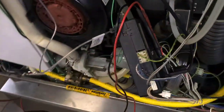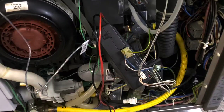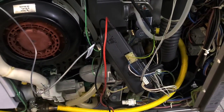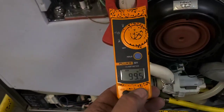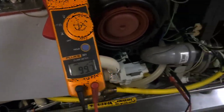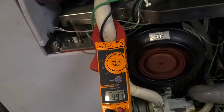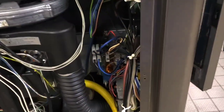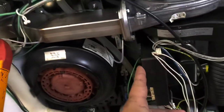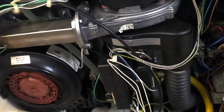So this stupid module needs to be changed — they replaced everything else except this. That was my guess anyway. There's no way it can't possibly be right. This valve will open at 99 volts, but I don't know. It's a 208-volt system, 120-volt ignition control system. It's faulty.